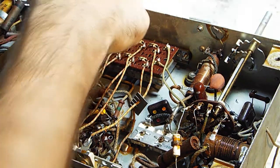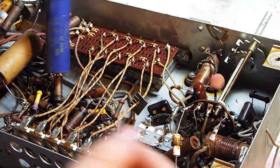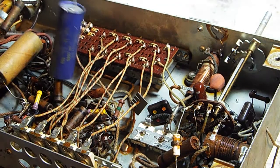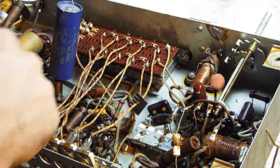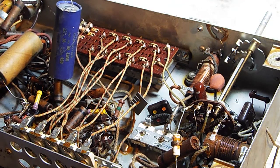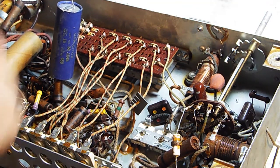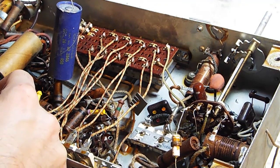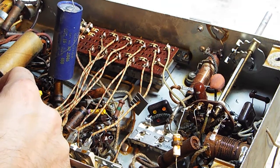But you can go a little lower or you can go higher, because these capacitors had a wide range for their rating. Well, not necessarily wide, but I can't remember how to put that. They're kind of weird. You can vary whatever you're doing with them a fair amount, and you can get away with it. Place that right on there. Make sure our solder gives us a nice joint on top of that old solder.